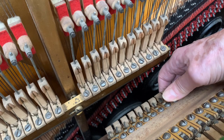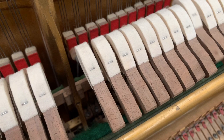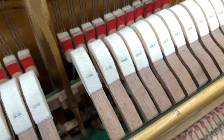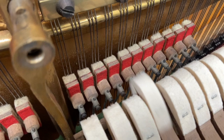We want the damper to come off slightly later, so you can push the spoon — you could use a tool, but if you get used to the feel of it after doing many thousands of these you can feel whether you're bending it slightly. Push it back in and see if it's right. Not quite enough — let's do it again. You can push it with your thumb to regulate it, then push it back in and see if it's lifting off. Roughly the same time now as the one next to it.